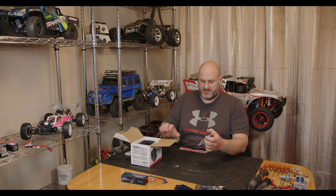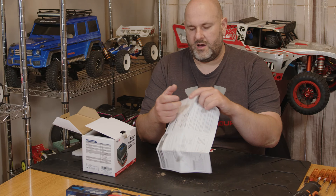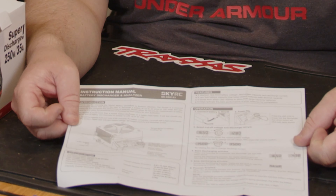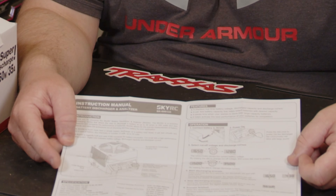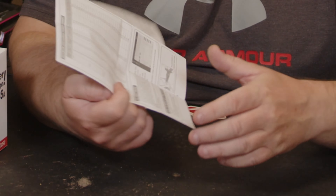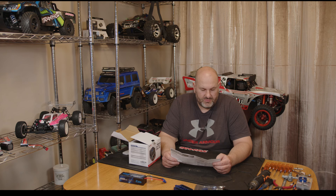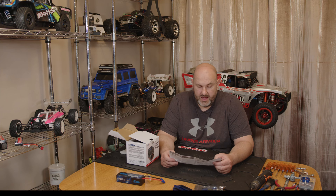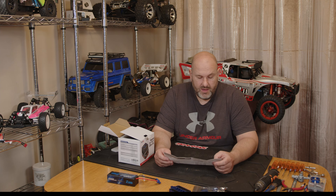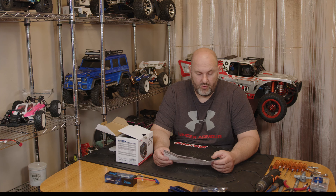Let's have a look at what we get in the box. First thing we've got is the instructions, and they are quite nice instructions. It tells you how to set it up, how to plug the battery in, and gives you a few stats on what performance you'll get. On the back you've also got a table showing that depending on the S of the battery you're using, it'll give you the minimum cutoff voltage they recommend — basically around 3 volt per cell. I wouldn't go any lower than that on LiPo batteries, and certainly not on HV LiPos — about 3.1 volt per cell is about the minimum.